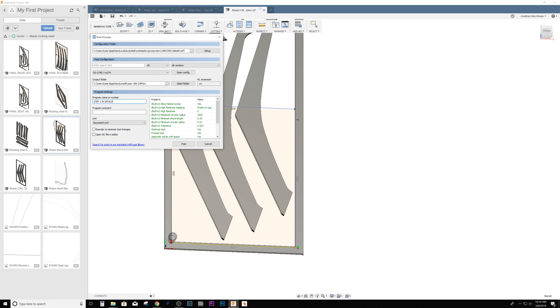We're going to draw our stock including a safe space where we can place our templates. I'm putting holes one inch from the bottom corners, making them eight millimeters so they are slightly larger than my pin, which is 0.3125 inches — that gives the pins breathing room so it's not impossible to pull them in and out. Then I'm going to draw a line that's 24 inches away, because that is the distance our stock will move when we change the origin for cutting the second half of the templates.